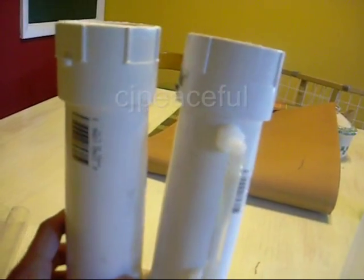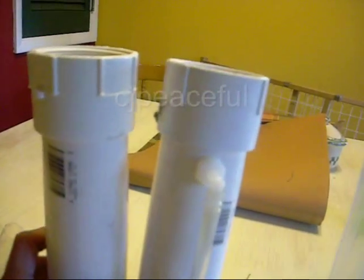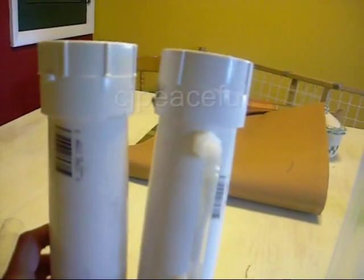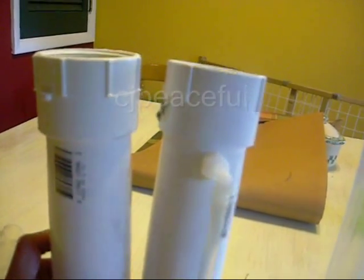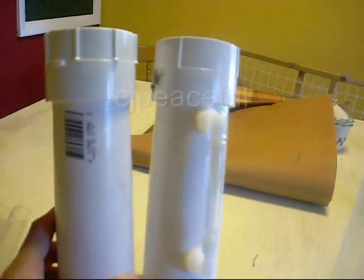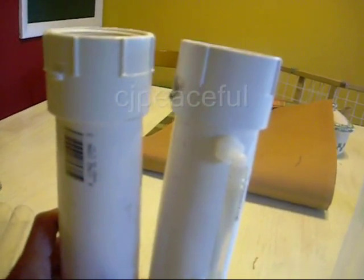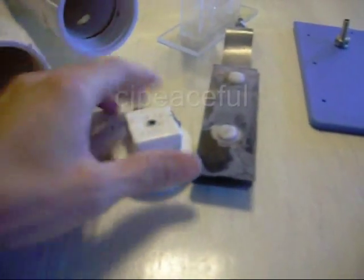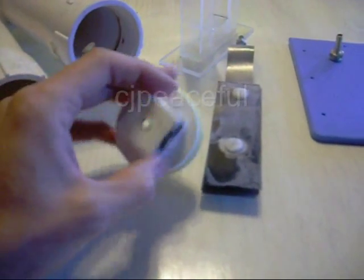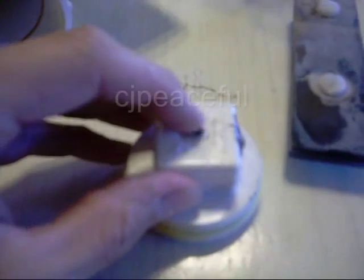That was fairly consistent for about a week. After that, once I increased the amperage by increasing my electrolyte to about 15 amps or so, the temperature exponentially increased to about 160 to 170 degrees. That's when I noticed the warping in the fittings — it was no longer creating an airtight seal, and the indentations of the washers actually started melting into the housing.